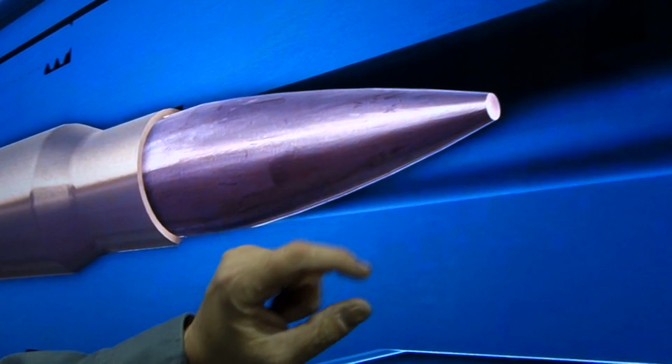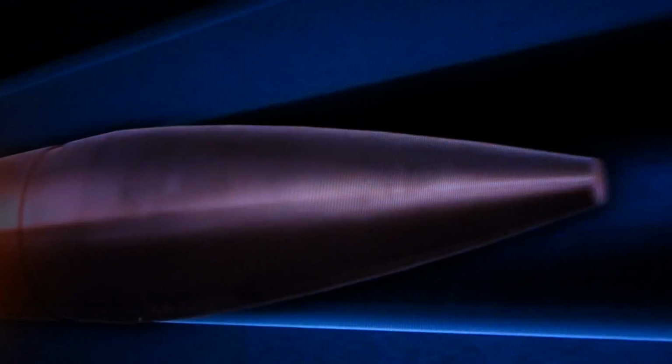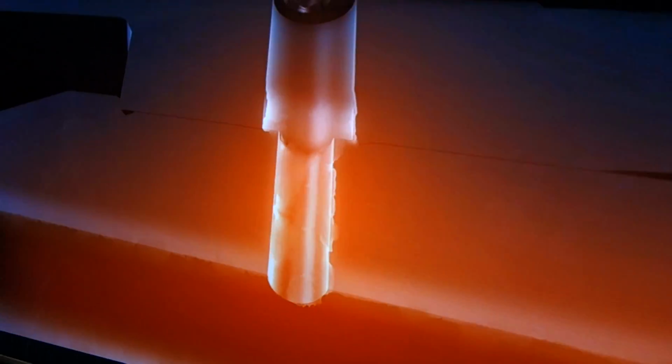We're putting channels in the neck, and they mean nothing until you put the cartridge in and fire. We seal at the shoulder. The projectile fires, the neck expands. The gases go around the neck in those channels and dead end at the shoulder. It's in lockup. It can't go anywhere. The pressure works the neck to free the neck up so it doesn't stick. As the action goes to move, it unlocks, the shoulder pops free, the extractor just follows the bolt carrier assembly as it gets pushed. The hardest the extractor's working is just going over the cartridge.